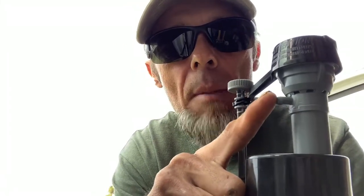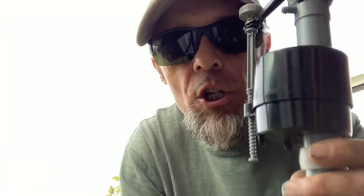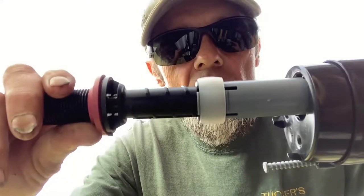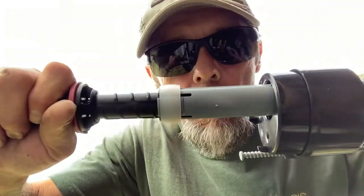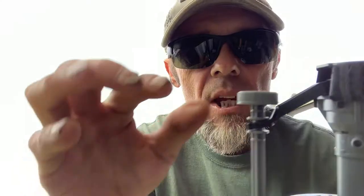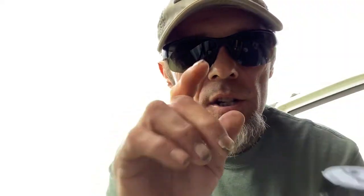Before we even install, we're going to set it down in the toilet. We want to see this little tube piece right here — where the hose comes out — be about a half inch higher than that tube that the water puts into it from the flush valve. Once you know it's going to be at that height, take that ring and slide it back into place just like that. Now that locks into place so it doesn't blow apart.